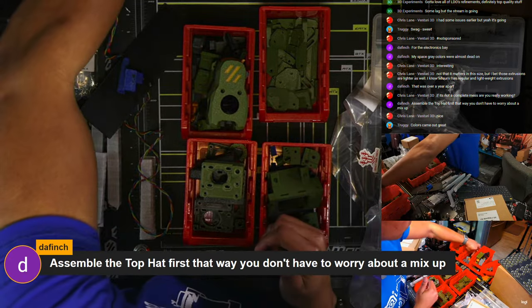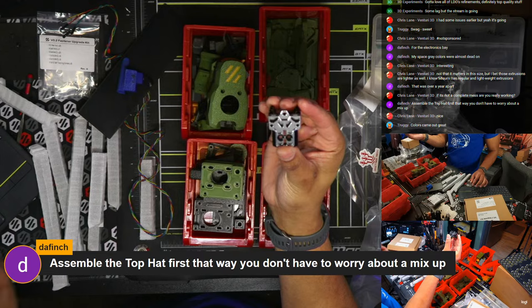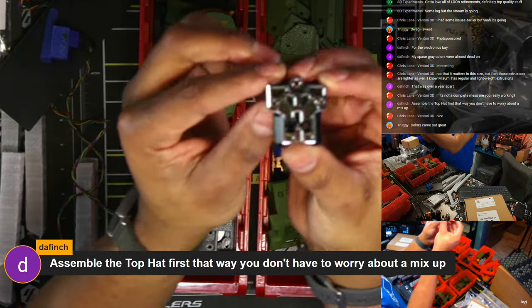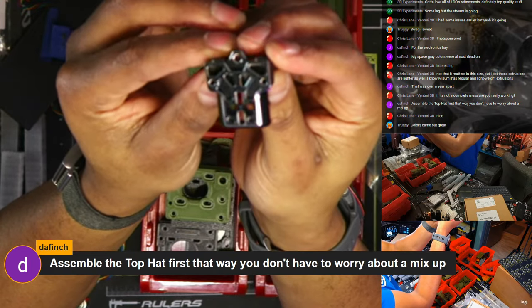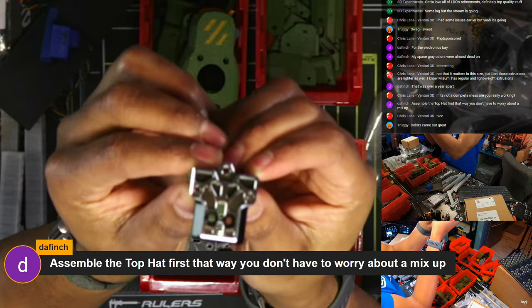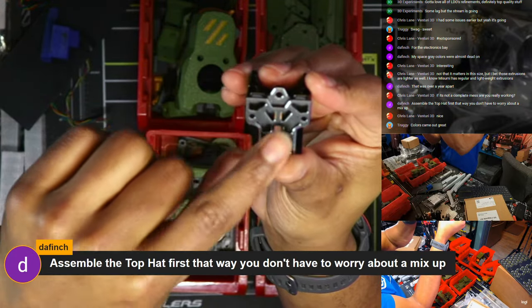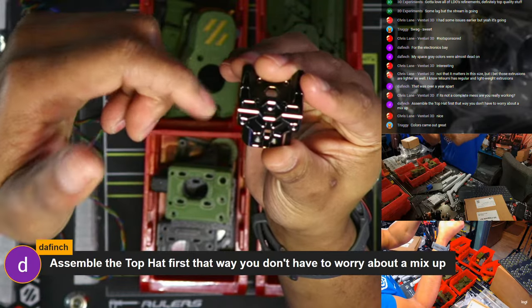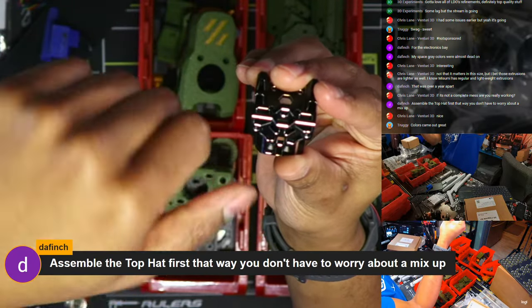I did order one of these guys. This is the CNC Carriage from Fabreeko. I started out my Formbot build using just the printed part, and it was printed by PIF and looked like really, really good quality. But instead of having CNC'd screw holes here with tapped holes, it had nuts that you slipped in, and the nuts started spinning inside of the printed part for me.